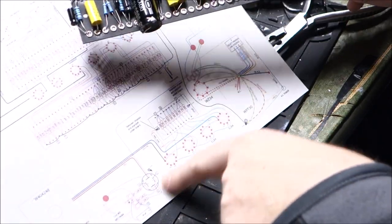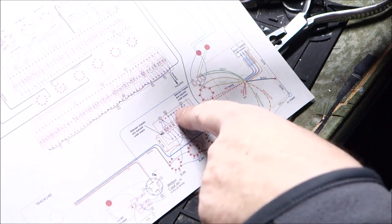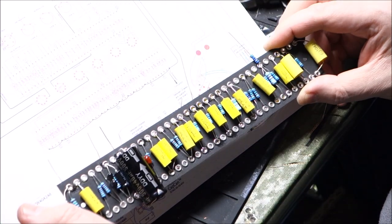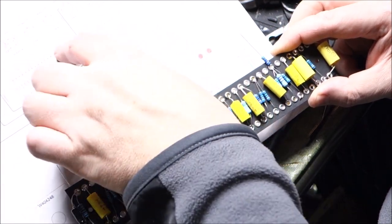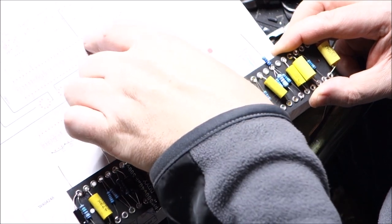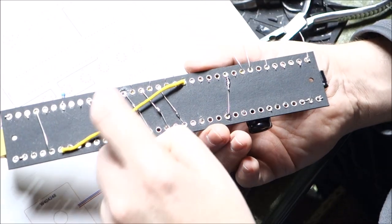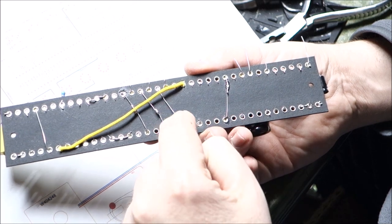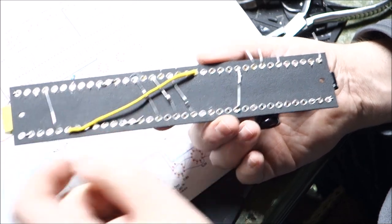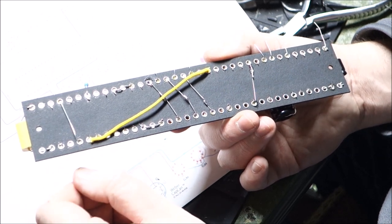down here in the power section. And then there's also X and Y, which are in the output area over here. So we'll be tying those in at a later time. There is a point P here, P as in Paul, and that is from there to there. And if you notice, there are some dotted lines, which are connections under the board. Short connections under the board, this is the one for the P letter there, but short connections that went under the board, I just J-hooked some leads together, or if the component leads were really long, we just were able to do that.